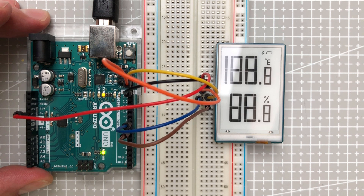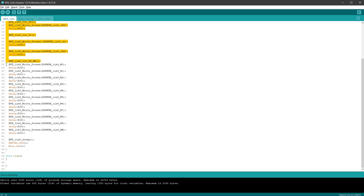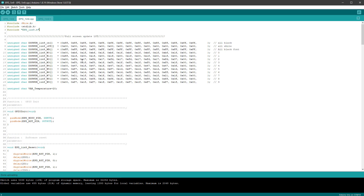Let's jump back to the code and see what's actually happening. First there's some initialization and turning the display on and off several times — something you would usually do with e-ink displays to make sure that the pixels or segments are displayed properly — and then the interesting part starts. We write the screen with values like DSP number 1inch9 w 0, 1, 2 and 3, which draw all zeros, all ones, all twos, and so on. If I open this CPP file, those DSP nums are actually variables prefilled with some values.